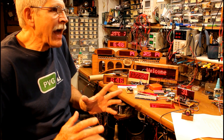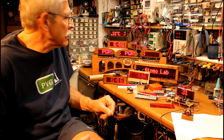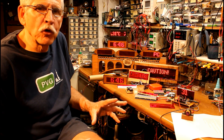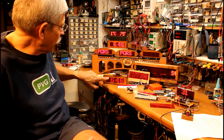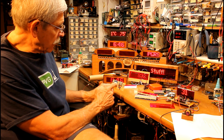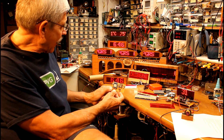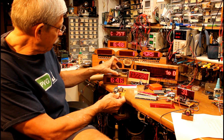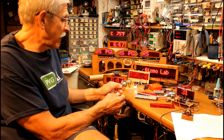Below the temperature display is a clock. I really like clocks to be accurate, and this one has an ESP8266 inside that goes out through my wireless network to the internet, grabs the time from Google, and resets about once a minute. Next to the ESP8266 is a DF player — an MP3 player — and at the quarter hour, half hour, three-quarter hour, and so on, it rings out Westminster chimes through a small speaker. I don't think we'll hear it during this video since the next chime is about 15 minutes away.